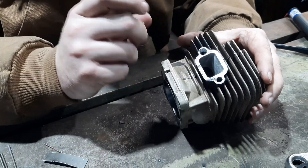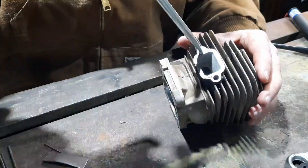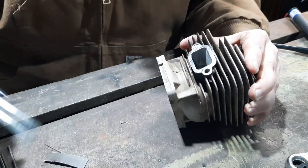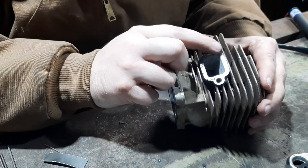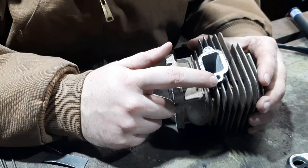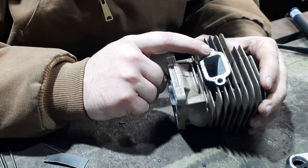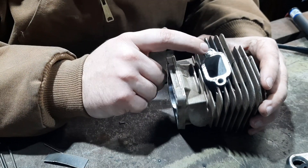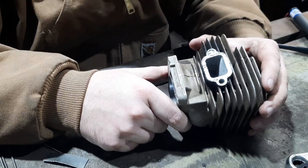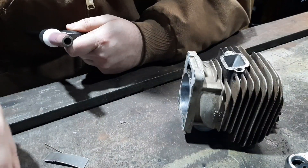I went bigger, had some aluminum threaded rod, so I tapped this and made a plug. What I'm going to do is put the plug in, tighten the plug down, and weld up this flange, then re-machine it, re-drill and tap this hole. The 661s have clearance close to the flange and the threads are actually down in the bottom. I'll take this up, get rid of these spots, resurface that, and it should be good to go. Fire up the welder — there's some fresh ground tungsten in there.